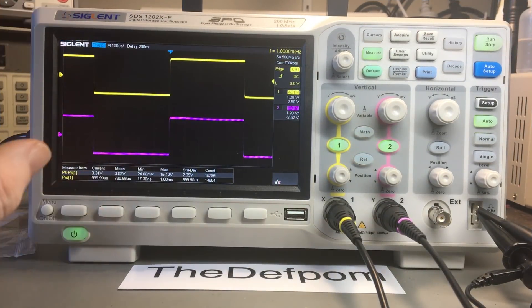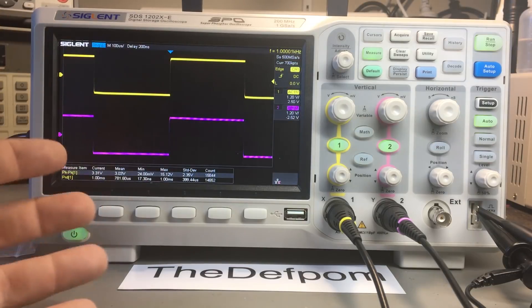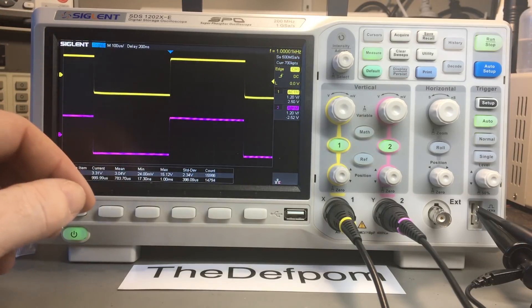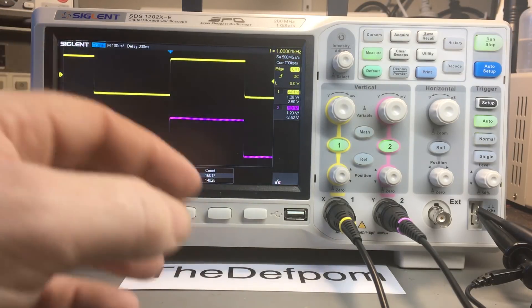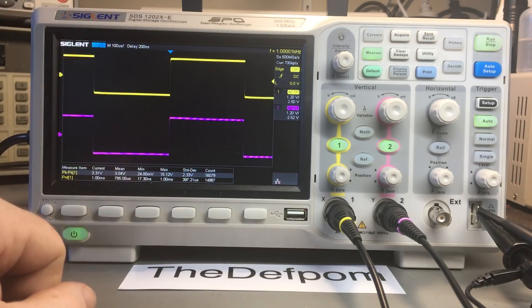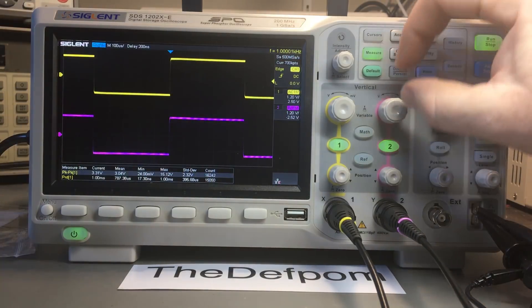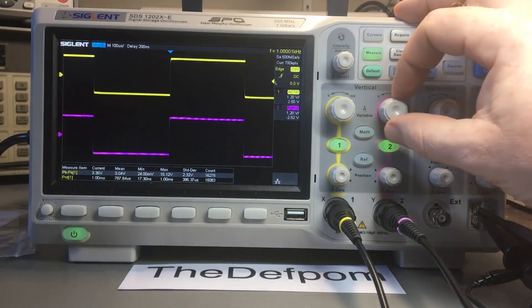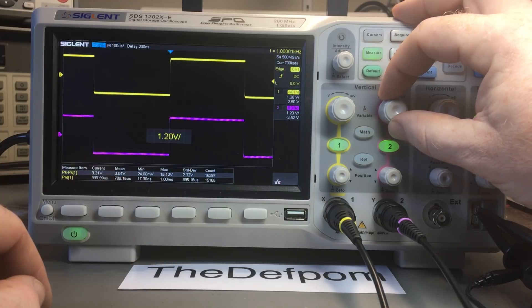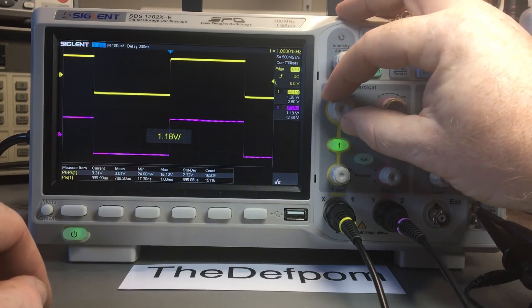I've now calibrated the adjustments - this is after the capacitor has been installed. If you look at the rework video, it shows you how to do the calibration. You use 1.2 volts and 12 volts peak-to-peak at 10 kilohertz to adjust the actual probe compensations inside. I've done that calibration and compensated the probes already. I've got both set at 1.2 volts right now. If I go to 1.18, you can see it's still okay - no probe compensation issue anymore.